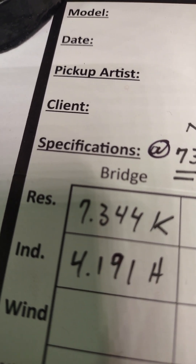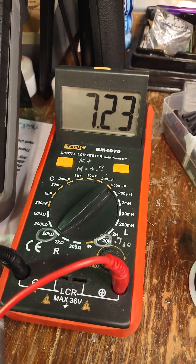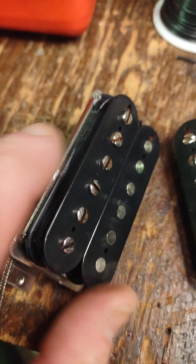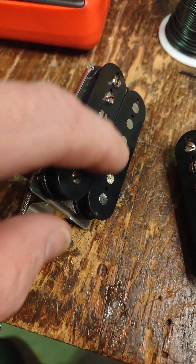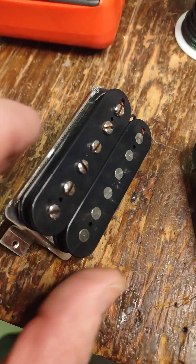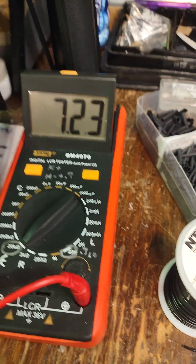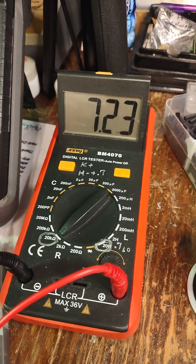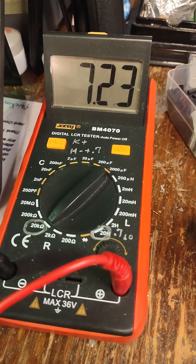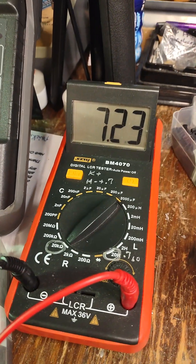So just wanted to let you know that for those of you who use the resistance of a pickup as a measurement of anything, you're screwed. One other thing I want to mention: this pickup — we could literally take all of the metal screws, all of the metal pole pieces out of the pickup, which would make it do absolutely nothing. It wouldn't even be a pickup anymore, it would not produce a lick of sound, and it wouldn't affect the resistance reading there at all. So that tells you just how useless resistance is as a reading.